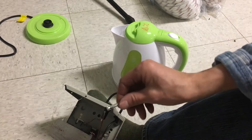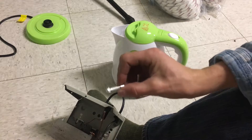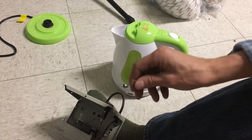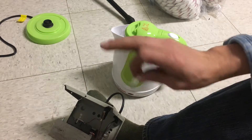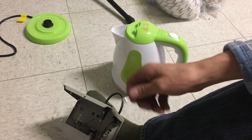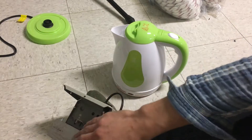If you take away anything from this little life lesson: always replace with the proper fuse. And if you can't find a 4.5 amp fuse, put a lower capacity fuse in — 4 amp, 3.5, 3 — whatever you can. If you overload it, it'll just blow the fuse. You'll blow sooner rather than later, and you'll save the expensive stuff.